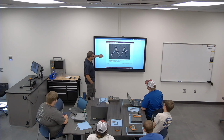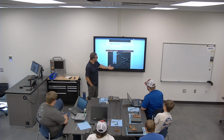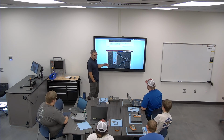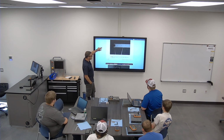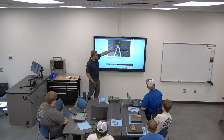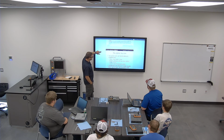So here's a spring caliper, and it's a transfer tool. You measure the outside of something, then you transfer it to gauge blocks or a scale or something like that. Did you do that last week on our first project? Yeah, but why would you do this when you could really just measure the part, or use regular calipers for it? So it ends up being, I feel like, an opportunity for error. Okay, so here's internal, and then they are adjustable here, and some of these have a firm joint that they lock. And again, you're going to talk about these things in metrology.